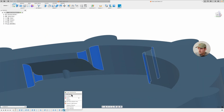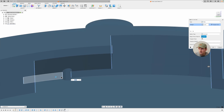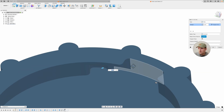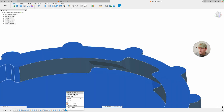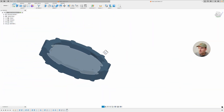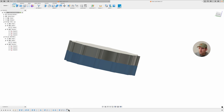When I was adding fillets, I forgot to add them to this, and that just makes the part glide on better. If you don't add that, it'll be a little bit more difficult to pop in and out. Some people might say it's plastic and it's going to break, but most plastic will break at some point - I still think it is a pretty effective design. Click OK, then just change your pattern here to select, make sure the fillet is still selected, and you should see that at all the little columns. So that is how you make a snap-in, twist-to-lock mechanism. The big important aspect is that your parts should line up - regardless of what your design is, if you have something where you want two pieces to align, this should work.